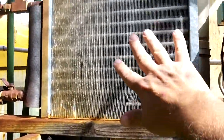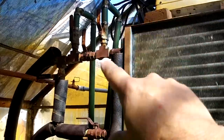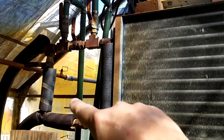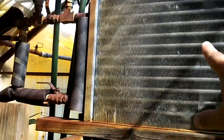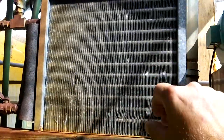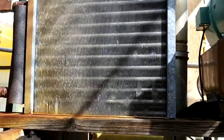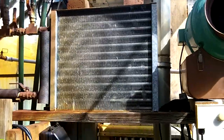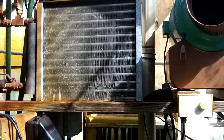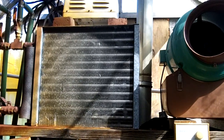The heat actually into the greenhouse comes from this — that's called a 100,000 BTU coil. Over here you can see the piping: those are the hot water lines coming from the outside wood furnace. That has a fan behind it tied to a thermostat, and when we hit our set point it kicks in and heats the greenhouse with hot air. I would prefer to have radiators here — I really don't like forced air in a greenhouse like this — but radiators would be a lot more money. That unit was $600.